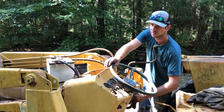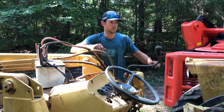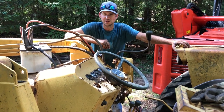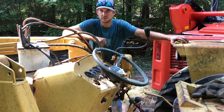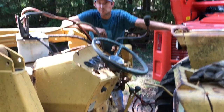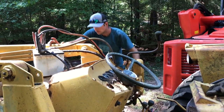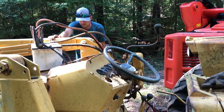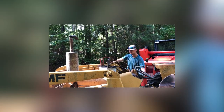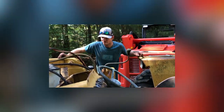I'm gonna hook the jumper cables up. Water in it? There's water in it? There was, just a little bit. That's why there's no fuel in here, it's all leaking out. Probably so. We could, if it'll crank over, we could just get the jumbo gas tank and just put an inline filter on it. Just see if we can get it running and then we can clean the tank. Yeah. Try it? I think we can get it running. Just need a little bit of fuel.